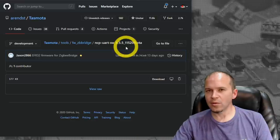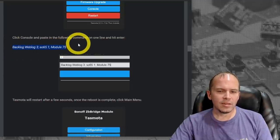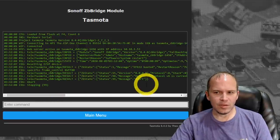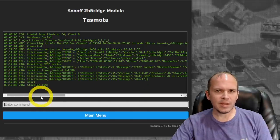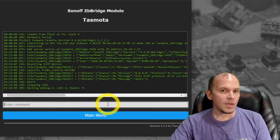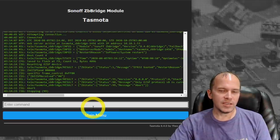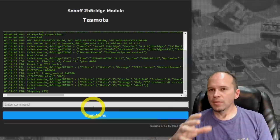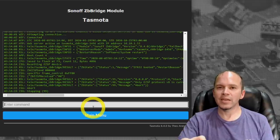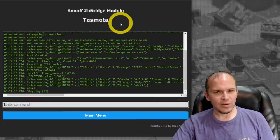If you don't want to do it with Home Assistant, you can download a later version and do the Tasmota Zigbee MQTT thing, which we may get into in another video. Copy the text command out of the blog, come into the console, paste it in, and hit enter. Give it a second and it's going to reboot. What I find easier when doing this OTA flash: we're about to flash the chipset of the Zigbee radio in the bridge itself, and Tasmota is going to take care of it all for us.